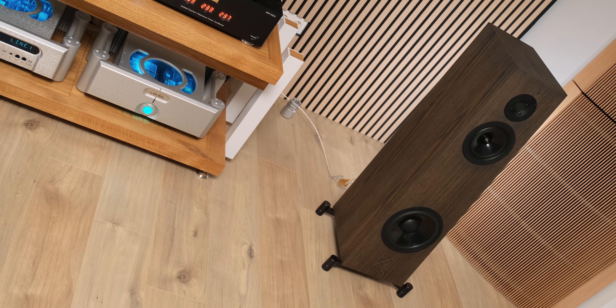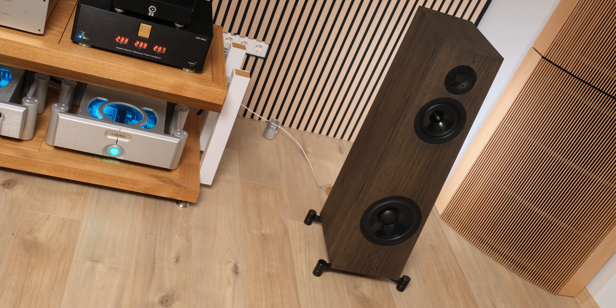Wrapping up — these guys have just kick-started their business, and they have one single requirement for success: their speakers should not suck. Of course, they also need to sound better than similarly priced speakers from established brands, offer proper support and warranty through a network of distributors, and bit by bit they are addressing these necessities. People often talk about enclosures, drivers, measurements, and spec sheets like the holy grail, but they forget that all the magic starts from within — from the crossover and the components used in it. You can destroy some amazingly engineered drivers with 10-cent resistors, and I'm not even kidding. The components used in these crossovers can be found in speakers costing from 20k to 200k.